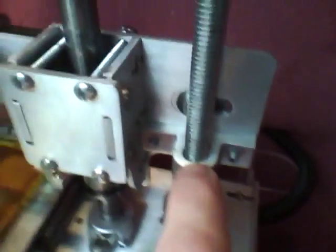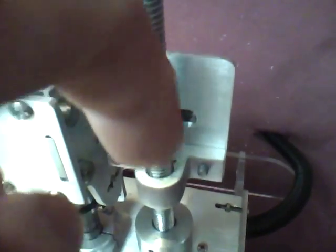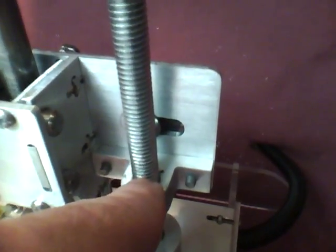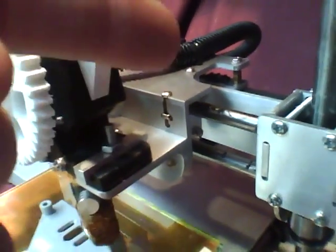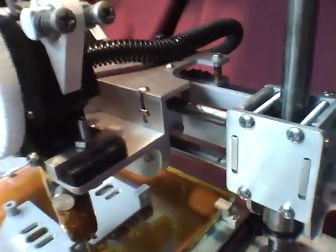The other thing with the layers: if you find layers labeled first, second, third, or one, two, three, that usually means I'm manually doing a pocket. For example, a hole might have two or three layers called one, two, three — where one would be the center hole, two would be a little bigger, and three would be the final size, so that whole hole is pocketed out. The little holdies for the extruder are also pocketed — you'll see a line, a rectangle around it, and a rectangle around that, labeled one, two, three or first, second, third.